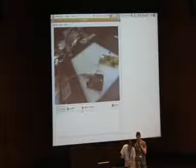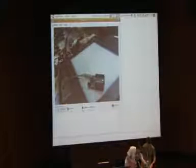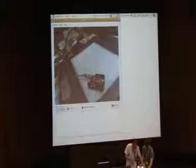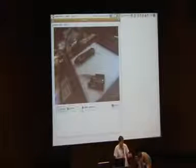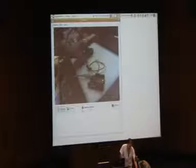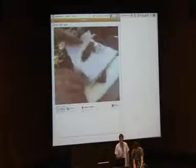And we're all good to go with the tape. So, hopefully the soldering iron is just about warmed up. What we're going to do is take these reed relays, wire them across the back of this appliance remote control. We'll load up some software that will let us pulse those outputs, and we'll see if we can control it.